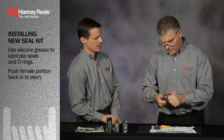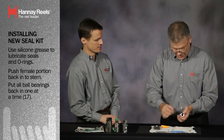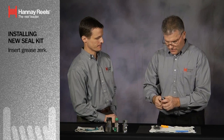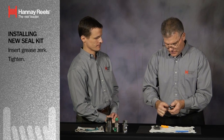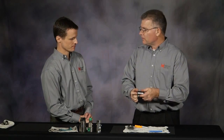I heard a good snap there. All held together — I presume at this point it's just a matter of putting all the ball bearings in one at a time. That is correct. Insert the grease fitting. Now once the grease zerk is placed, we'll tighten him back up. He's all set. And with a manual hand grease gun, we can take and grease this basically an eighth of a pump — there's not a lot of room in here for the grease to go, but that swivel's ready to go.